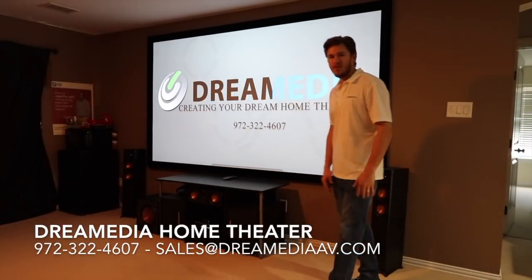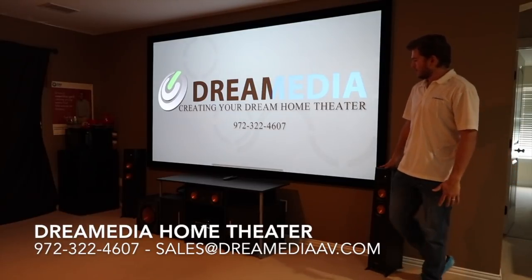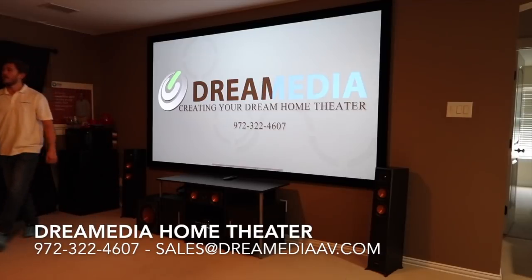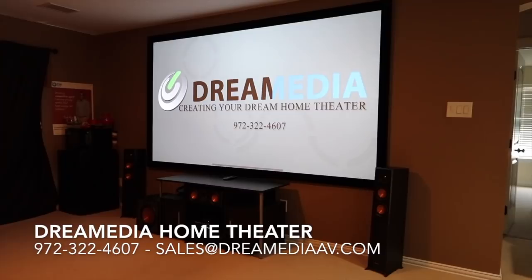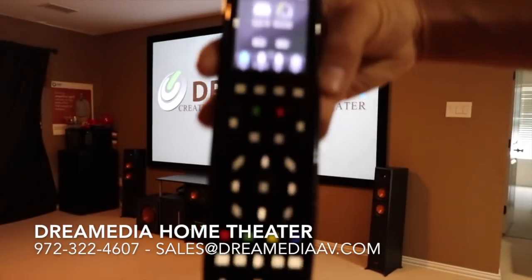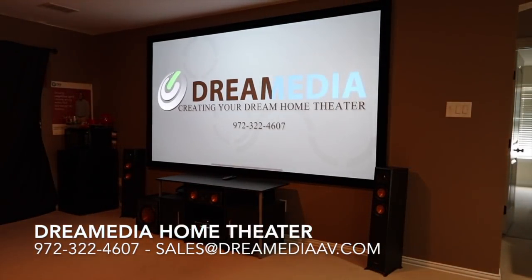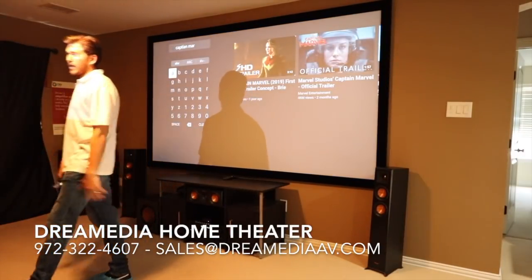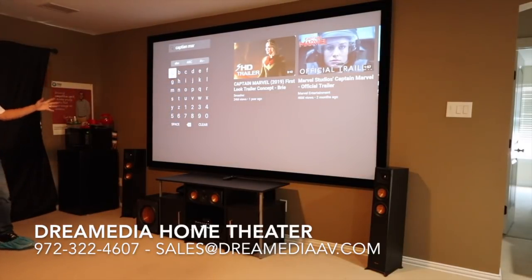I wanted to show off this system that we just completed today. We're using the Klipsch RP4000 floor standing speakers in the front of the room, the 400 center speaker, as well as the R100 10-inch sub here, and then our custom series in the rears, which is the complete 5.1. We're driving everything with a Denon AVR-X1500H using Apple TV for music streaming, and then using a 1-button press touchscreen Pro Control remote for operating the system seamlessly. Let me show you that right here. This makes it very easy for the customer to come in and press 1 button and operate the entire system. Customer's happy, I'm happy. This is a great value projection system, as well as AV system. The whole system came in a little bit under $6,000. On the video side, we have the Epson 6040, and we're broadcasting onto the 120-inch high contrast gray screen.